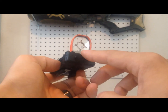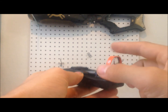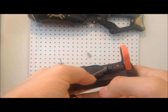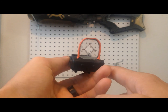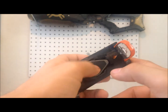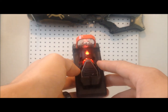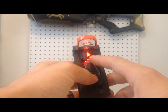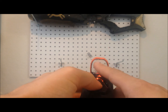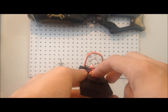The front plate is polycarbonate, heat molded, and secured in place with screws. This part right here is actually a trigger catch from some Nerf gun — I've got a drawer full of random parts and I came across it one day. It's powered by basically just a keychain emergency flashlight — it glows red. I put a particular hole there on purpose so it would deflect the light onto this crosshair, and when it's in the dark it actually glows like the one from the game.